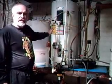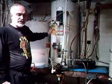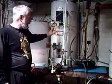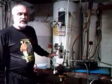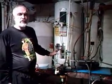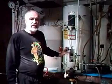I do this to, one, help settle any moisture that's in there out, and then also I take a sample of that oil at 130 degrees and I run some chemical tests on it to find out what the pH level is and whether it's acid or base or what.